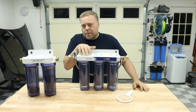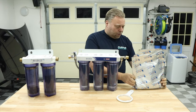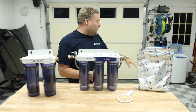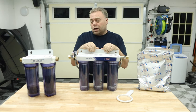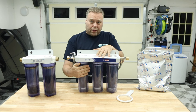The color-change resin is a little more expensive and not any better than regular resin. I picked up this bag — no, this is not a kilo of Colombian Bam Bam. This stuff is $45 for seven pounds, enough to fill two of those huge 10-inch canisters at three and a half pounds each. Each of these smaller ones is 1.25 pounds. This first resin filter gets hit first, then subsequent through the other two, so it will deplete faster than the other two.